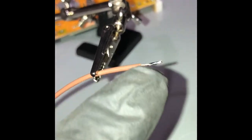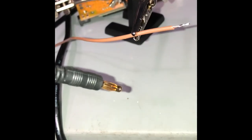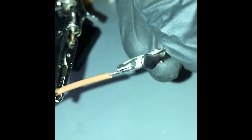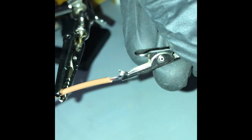I tin the end of this copper wire — it's going to be my output to the 6-volt battery. Here's the other end where I need to get an alligator clip on. I've got these alligator clips; I'm going to get one on here like so, roll the edges over, and solder it.